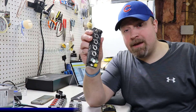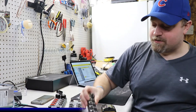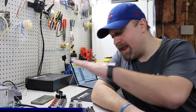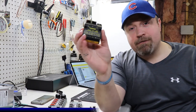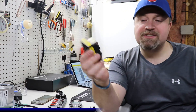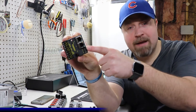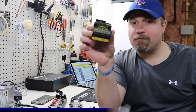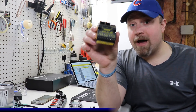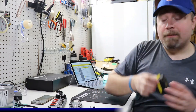They have their T-Bend S2 series, which is their more compact version. This comes in both M12 and M8 connectors. And then if you don't want something outside the machine but you still want remote I/O, their FEN series is great as well. This is the FEN-20 — a 4-input, 4-convertible input-output device. I'm going to run my RJ-45 into here with my power. I can daisy-chain to future devices, and this is a very compact device to have remote I/O for machine monitoring over Ethernet IP, Modbus TCP, or even Profinet.